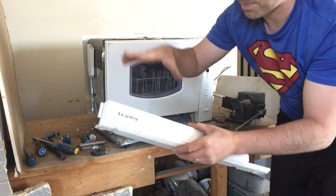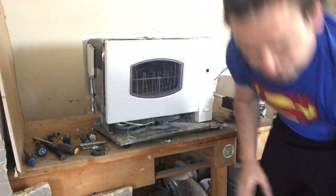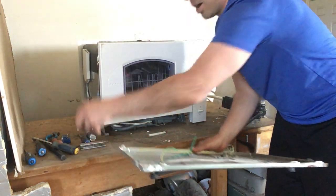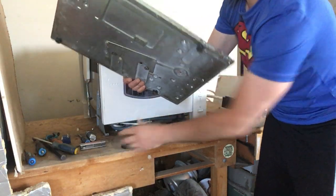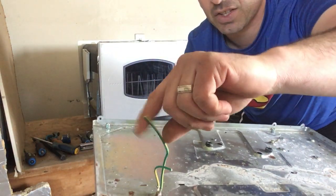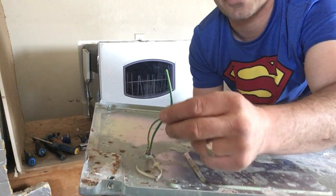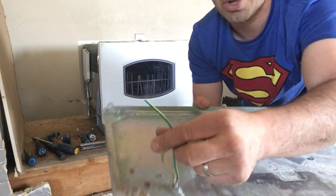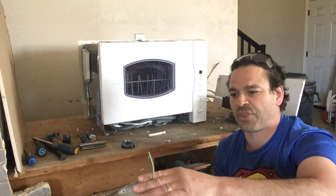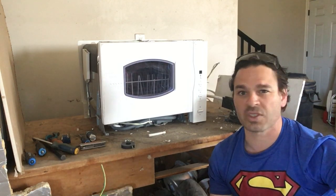The bottom plate here is plastic — unfortunately no scrap value, but because of the thickness I can put this into recycling. I have also removed the bottom plate, which is magnetic, so this is going to be tin shred as well. It does have some really nice wire on here. This wire is single-stranded with one coating of plastic, so this is going to be classified as 60% appliance wire. Currently in London, Ontario, this wire is going for $2.74 a pound — a great price. You definitely want to make sure you separate it from 40% appliance wire, which I'm going to talk about in a second.